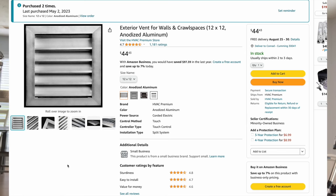I did do it successfully. The front vent is 12 by 12, and the one on the side for the fresh air intake is an 8 by 8. Both of these you can find on Amazon by looking up 'louvered vent.' They are 100% aluminum, and I sealed all around the edges with butyl tape before screwing them onto the aluminum.